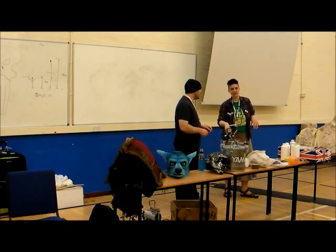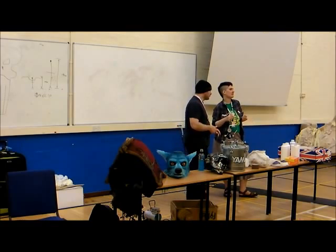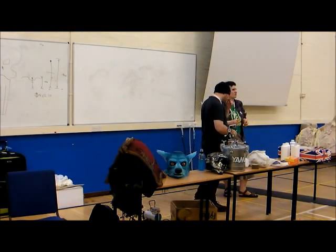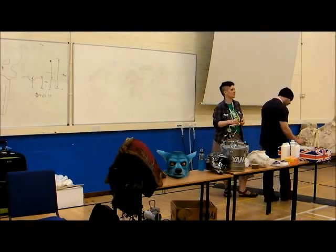We haven't brought everything that we cast. We often cast claws for fursuits, jewellery fixings. When I did Kimari a couple of years ago, all of his large jewellery fixings were actually cast in latex because I needed them to be flexible and soft and extremely strong. Latex is actually a very good material for that sort of thing. It's got its limitations, but it does have a lot of good uses as well.